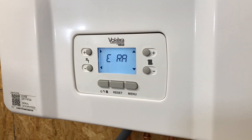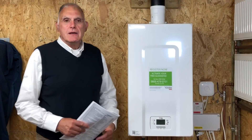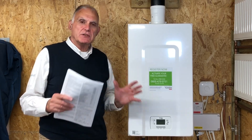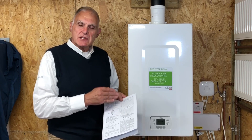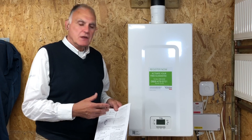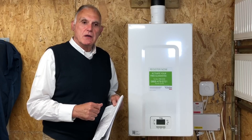If I needed seven kilowatts I would choose a lower number, but let's say it's 10 kilowatts - I've set the fan speed to 2800 RPM. When happy with that, press the enter button. That's now locked the maximum heating output from the boiler to the heating system at 10 kilowatts. To leave parameters, press the return button - we're back into standby. To recap: we haven't turned the boiler off. We've reduced the maximum power it will produce for central heating to the level the property actually needs. For central heating it will produce 10 kilowatts, but it will still preserve the maximum output of the boiler when hot water is called for. Using this graph, we can decide how much heat the property needs and choose a fan speed that limits the boiler output accordingly.